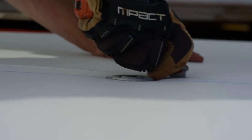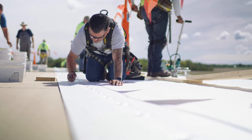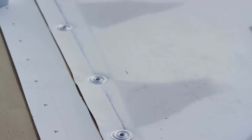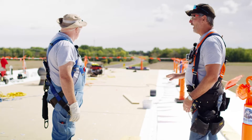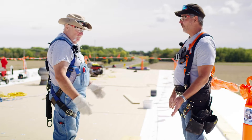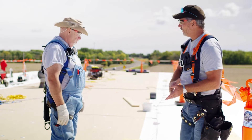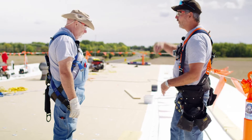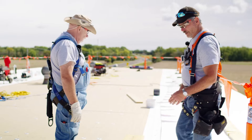As you can see down there, the guys have already located where our fasteners go into our purlin — because you absolutely cannot lose that purlin. Now, we always talk about never snapping a chalk line on TPO, but in this case it's going to be under the seam, not in the weld area, so it's not the end of the world. We really have no other option. We just have to make sure all these fasteners are into the purlin and not into the pan.